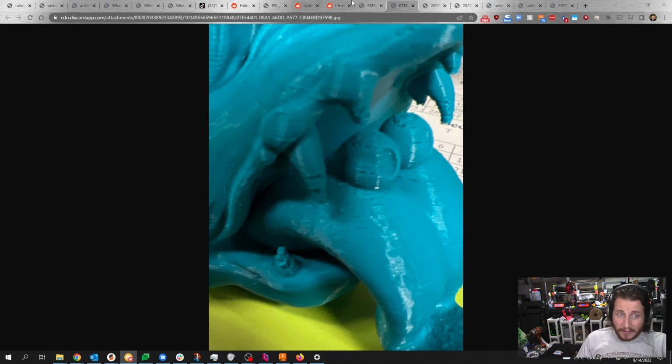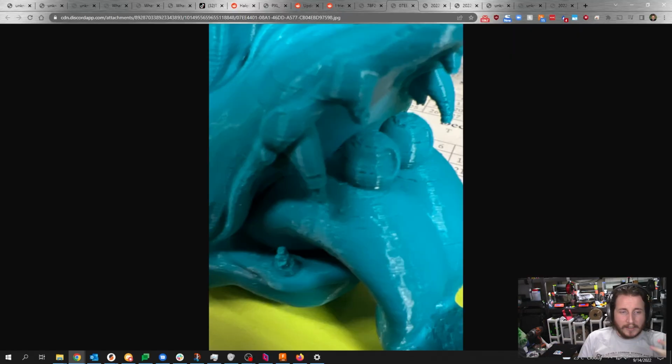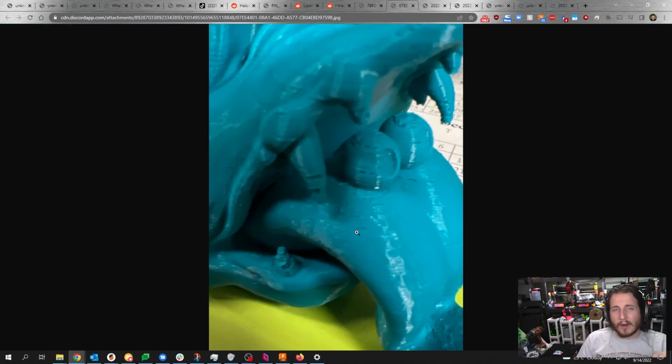Now, this is the same Ender 3 as this print here. Now, he is using a dual gear extruder. He is using Capricorn tube, but as far as I can tell otherwise, the printer is relatively stock. So what does that mean for the part that we're looking at? It might just be that you got too much retraction for very little amounts of printing, because we can see when he looks at printing larger areas, it doesn't seem as bad, but we do definitely still have some artifacts.